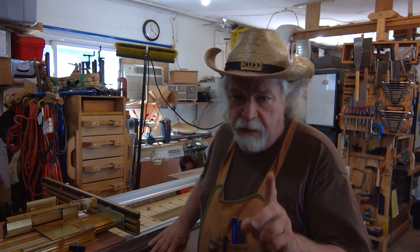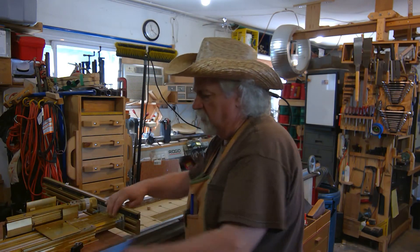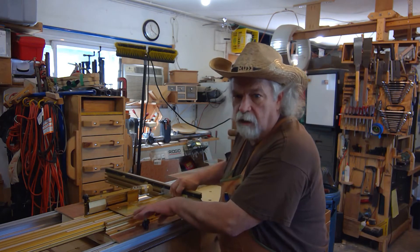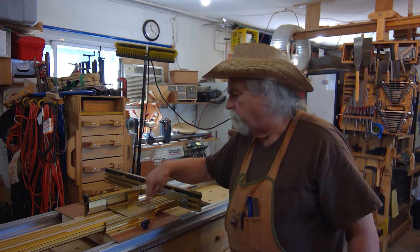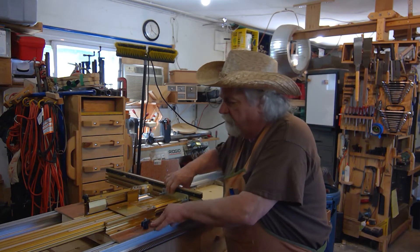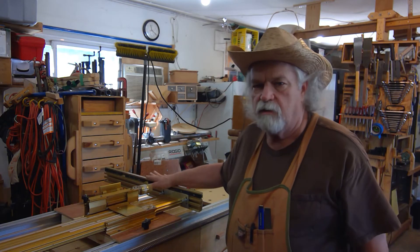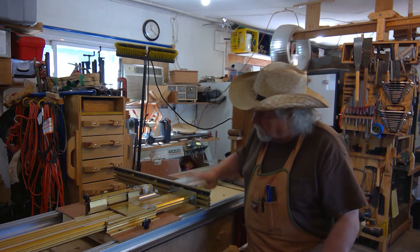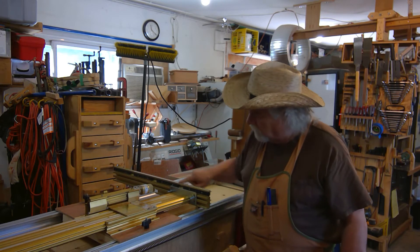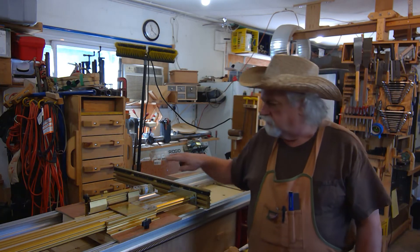To begin with, this is the ultra system — one of the earliest versions of the Incra system that fit on the table saw. This is just the basic unit. It has the carriage here, which is stationary, with the locking mechanism and the key for reading the scale so you know where your increments are. The templates all go into the rail system, so you have the rail that slides along the carriage. When you get it where you want it, you lock it down. The third piece is the fence itself — the old router fence — and it has its own ruler on this part that you can slide back and forth. So you get four scales on the rail here and one scale for the y-axis.